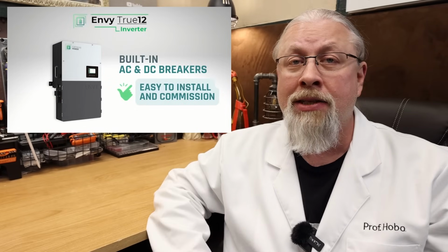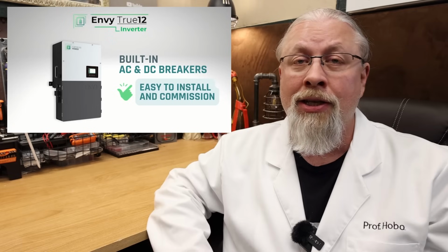Having a 200 amp pass-through makes for a much easier installation since the inverter can be installed inline at your main service entrance. That's unlike a lot of other inverters that require a lot of rewiring to integrate. Outdoor installation, you say? You bet. The NV and eFlex batteries are both rated IP65 weather resistant and can be installed outdoors if needed. However, the batteries are not heated, so if you live in an area that experiences regular below freezing conditions, they should be installed either in an insulated location or heated somehow externally.